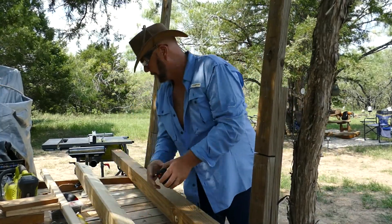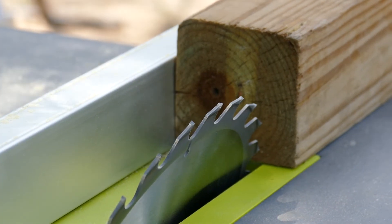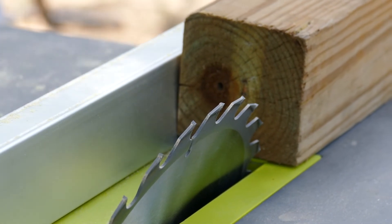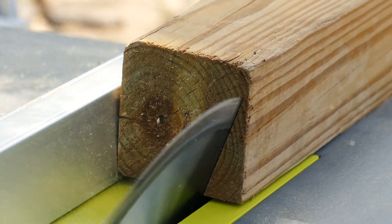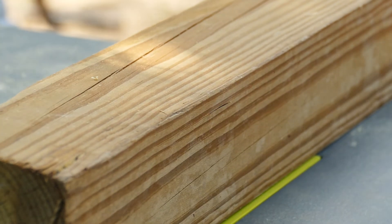I was very careful when I laid these out to cut them at the same place on the corrugation. You want to cut the exact same wave — that's why this works. I cut one and used it as a template for the other side, all the way around, with no mistakes. However, this 4x4 has a twist in it, which is already causing problems.